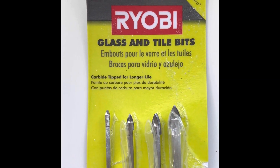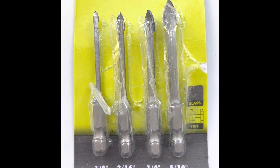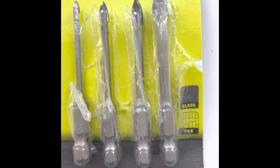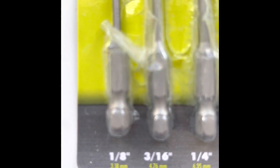If you start drilling holes you could end up right on top of a screw or nail that's already there. Last but not least, drilling in tile is always a little challenging — you don't want to crack the tile. The masonry drill bits I'm using I have used for a few other projects for drilling into tile, and they've worked wonderfully well. For this particular project I use the 3/16th one.